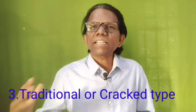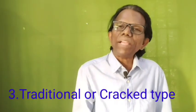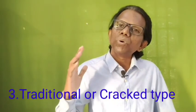And the third type of breading is traditional or cracker type breading crumbs, which are usually white or colored breadcrumbs with minimal or no crust on the surface of the crumbs. This type of breading has a flat, flake-like structure which can be easily used on a high-speed breading process line. It is usually made into a fine granulation which results in an even surface on a coated food product.